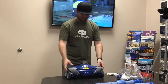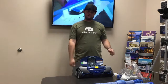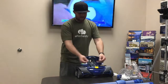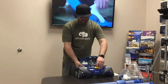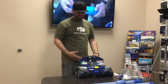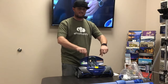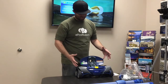This is how you open the cleaner — no screwdrivers, nothing. There's a quick tab right here; you press it down, open it up, and clean out any debris. You can see if anything else is plugged in there, and force it if there's a rock stuck. Worst case, if you have something stubborn, you take out these four screws and this whole assembly slides up, giving you access to every internal in the cleaner.